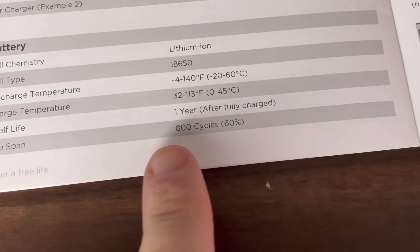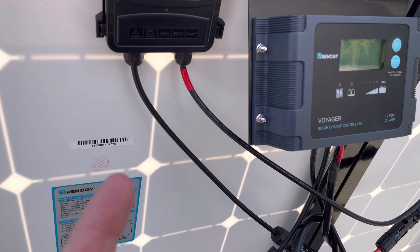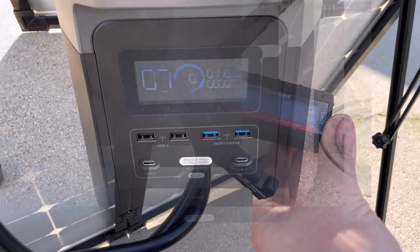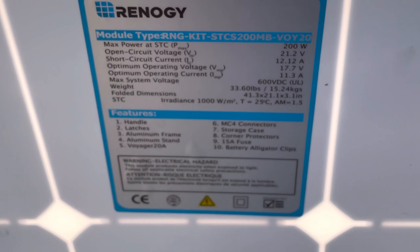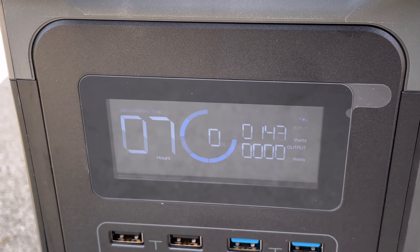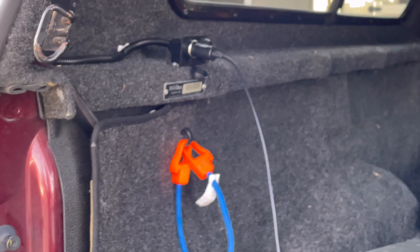As we take a quick look at charging it up with solar, I put my solar panels out here a little while ago so they could heat soak and we get some real numbers. I got my light meter out to try to get the best angle of the sun, but I kind of ran out of adjustment on the solar panels so I did the best I could. On this Renogy solar panel set, it has a PWM charger on it, which you don't want to use because the EcoFlow has one built in that's much more efficient, so you just bypass that. As we look at the EcoFlow, you can see about 150 watts are coming in — checking with our PowerWorks meter it's 154 watts at almost 10 amps, which is pretty much max what the EcoFlow can handle. Even though this panel can put out about 11.3 amps, it's doing pretty well in the sun, and the EcoFlow shows it'll take about seven hours at this rate.